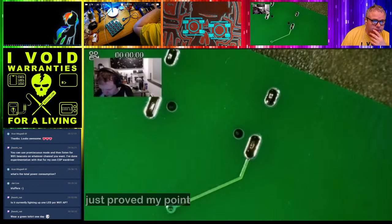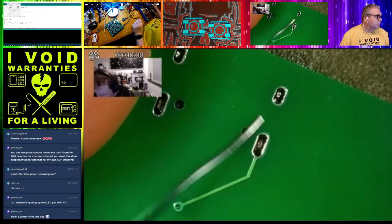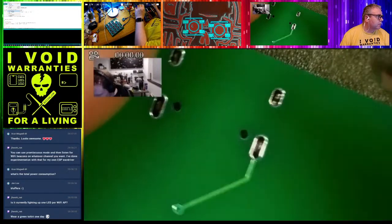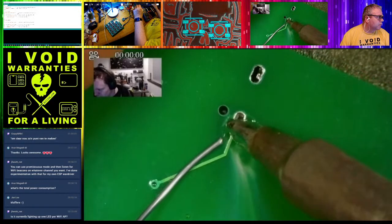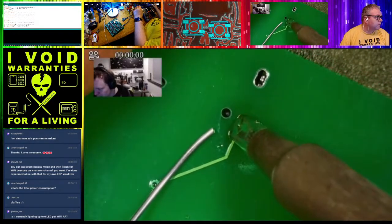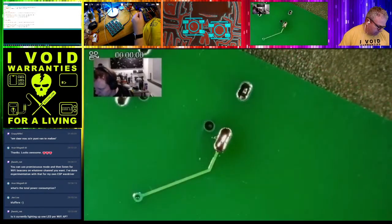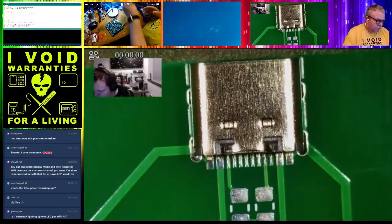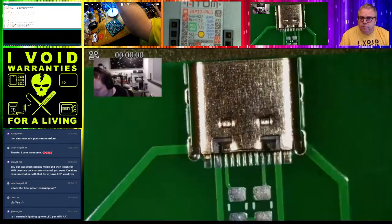And I'll first do the mechanical ones and get some solder in there. I'm heating up to about 320, 330. I'm pushing on the board so it's all flat and level. I'm doing one corner. Let's suck up some heat and suck up some solder. And there we go, it's stuck. Now I need to check if it's all nice and straight. That's fine, all nice and flat, also fine.